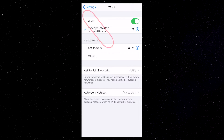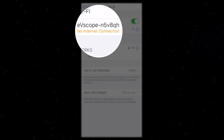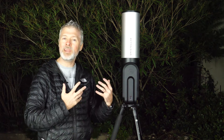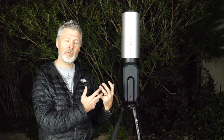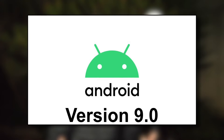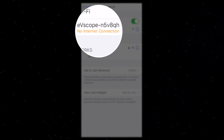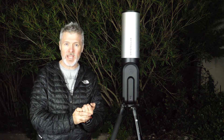You should be able to see a network named EV scope followed by six random characters. Really important: if you see a "no internet connection" message, this is totally normal. The EV scope creates a Wi-Fi network but it's not an internet connection — however you've still got an internet connection on your phone with 3G or 4G, just not Wi-Fi. One thing though: if you're on Android you must be on at least version 9, otherwise the message that you have no internet connection is correct.